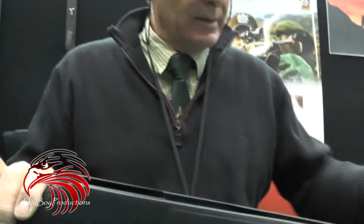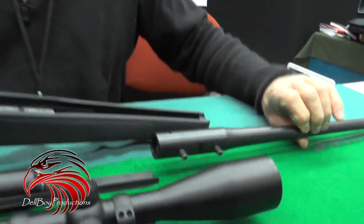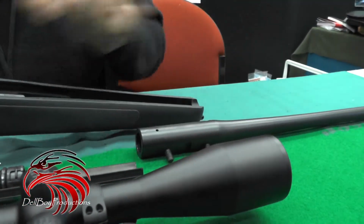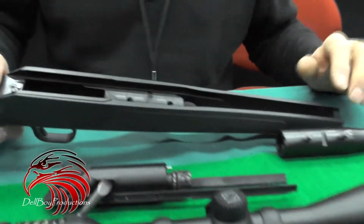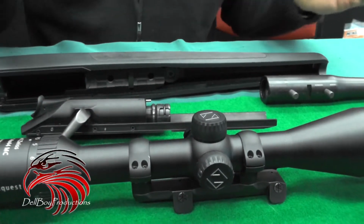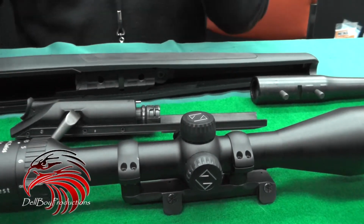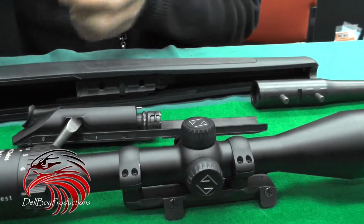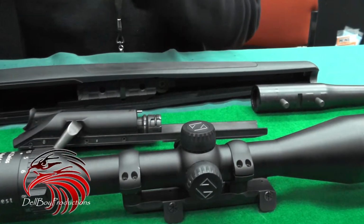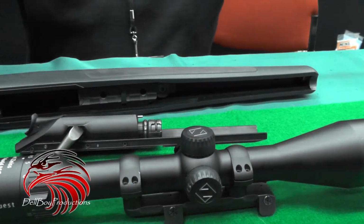The recoil lug is actually inverted and is under the energy source, which is the chamber. Okay, energy source is here. And the reason for that is, you take most bolt action rifles, the actual recoil lug is either a plate on the front of the receivers, as in some brands, or it's welded or bolted or machined in under the receiver. Yep. Back here, energy source is here, recoil lug is here.